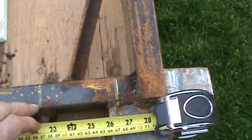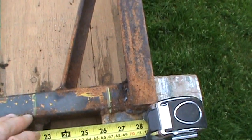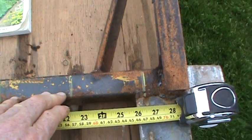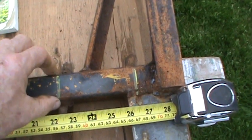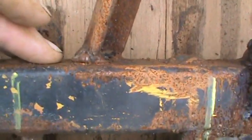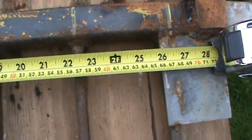What you do is use a half-inch drill bit. You start out with a pilot bit, and you square it up on both sides and drill both ways so you have a square hole. Otherwise, if you drill from one direction, your hole won't be square. If you have a drill press, you could do it, but I'm using minimum tools — just a hacksaw and a welder to build this thing, and a cordless drill motor. So you drill this half-inch both ways. This tine is half-inch mild steel, 19 inches long. You slide this tine into that hole that you drilled, drill all the way through to the other side, and butt-weld it right here on the side. You can see the butt-weld — it goes on through, and you weld it on this side too.